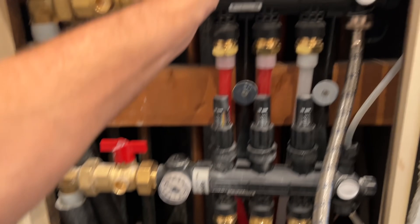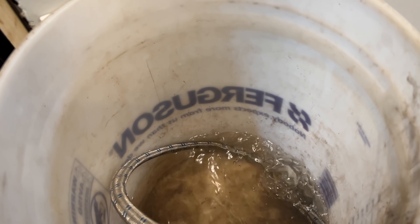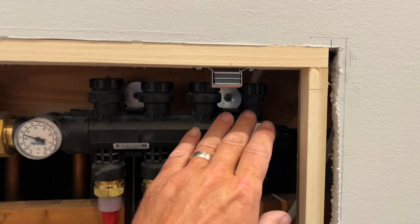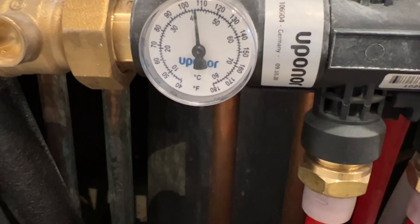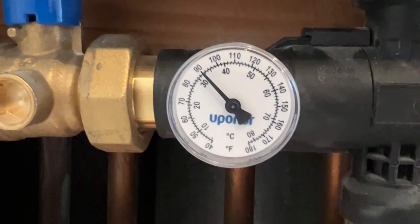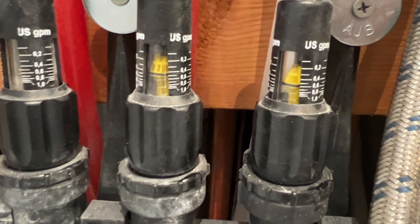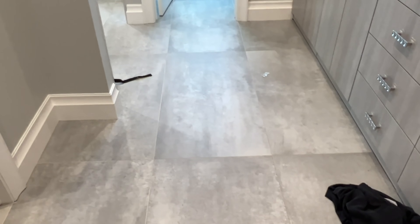Let's open this one back up again — a lot of air. Get all that air out of there. It'd be nice if they had an auto air vent on top of these manifolds. I wonder if that's an option, Uponor. I adjusted my mixing valve for about 120 degrees and we're circulating — the floor is absorbing that heat. I have all my flow valves set for 0.4 gallons per minute. We'll start there and see. If some loops are shorter than others, you need to adjust flow so the whole floor is evenly heated. But every single loop here is identical in length, give or take maybe 10 feet.